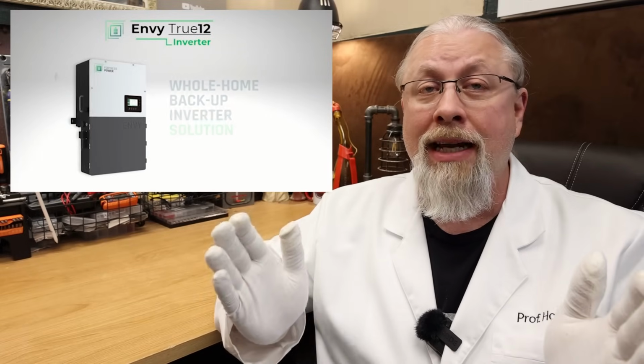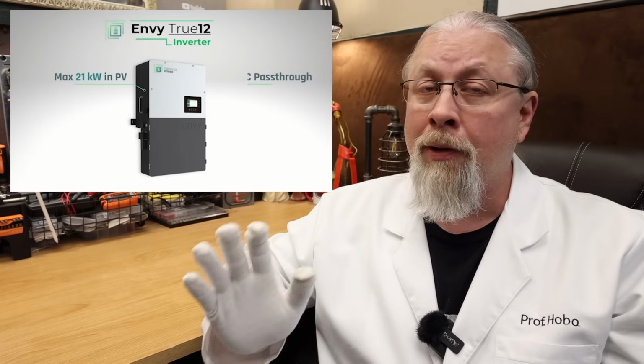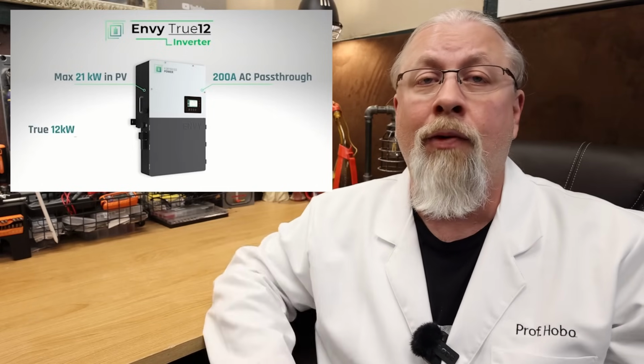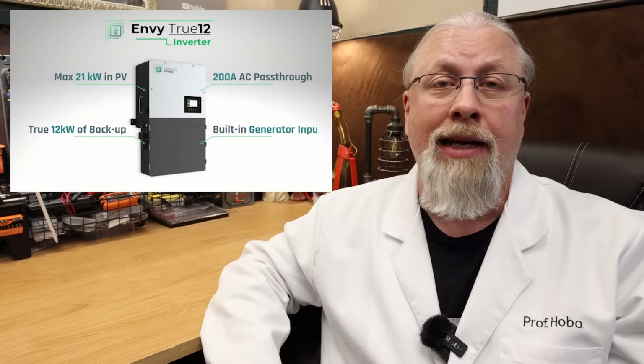Now this is unlike other 12K inverters that output less than rated power while AC charging the batteries. This power can be output in either split phase 240 volts, standard residential service in the US, or a 208 volt split or 3-phase service. The NV features a massive 200 amp pass-through that enables sending your entire residential service through the inverter while providing a 50 amp backup for your entire home with a UPS switchover time under 20 milliseconds.